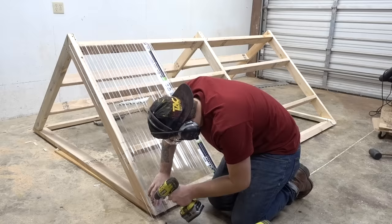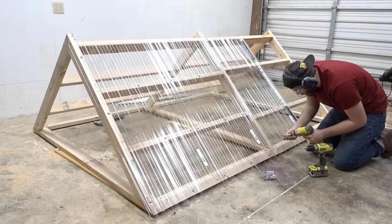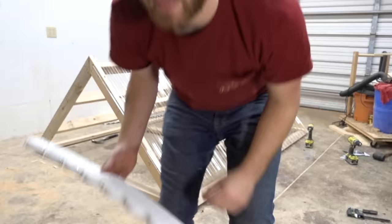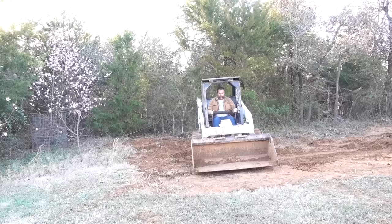Then I propped up my whole roof assembly on some 1x4s to create an overhang on the bottom of the roof and installed all of my roof panels. You want to make sure and get the right type of screws that have a rubber washer that expands with the pressure — that makes a really tight, watertight seal. I also needed to install foam closures on the corrugated panels; these go into the gaps to prevent water and rain from getting underneath.